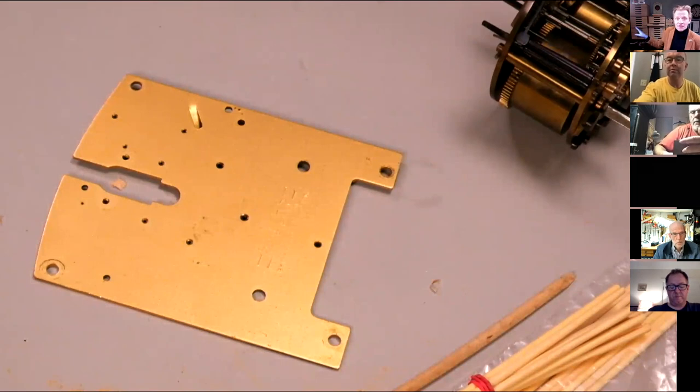But I found what is like the best thing ever, because what happens is you start with a pegwood, it's been in the drawer, it's dry. I always peg out in the actual solution. So the pegwood goes into the hole, it starts soaking up the fluid, and then it expands and breaks off in the hole. And it's really difficult to get the pegwood out of those 0.6 millimeter, 0.5 millimeter holes. So two things there, two top tips.